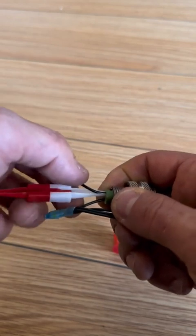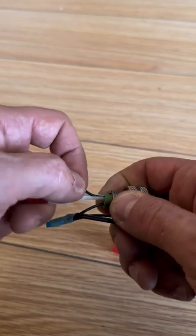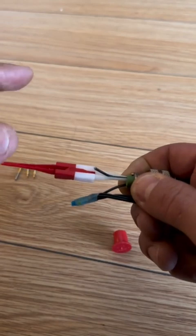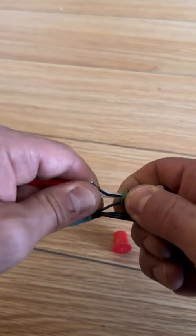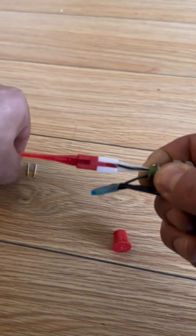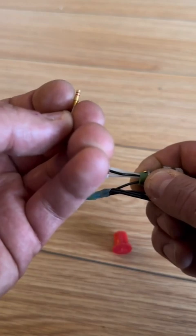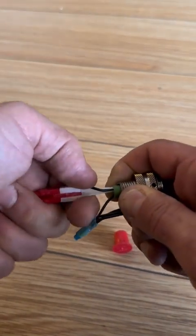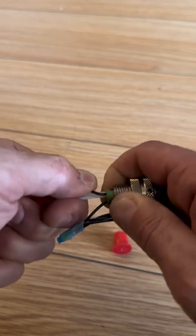Do this very slowly. The wire is very short, so you're going to have to bend it just slightly — not too much — just to get some grip on it. Obviously the wire will be longer in practice, extending out through the wire bundle, but this is just an example. Once you get down in there, you'll feel the tip of the tool slip over that lip — this right here — once that's done, you'll feel it.